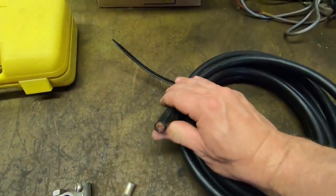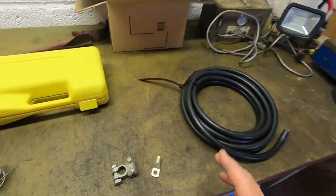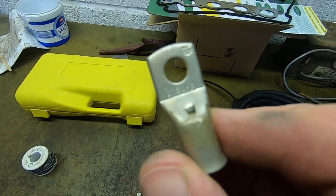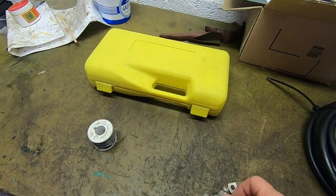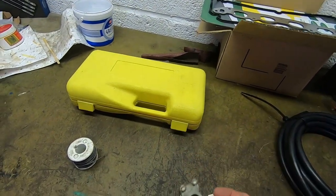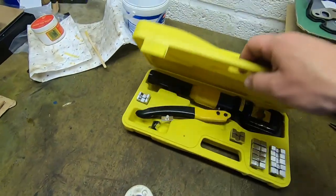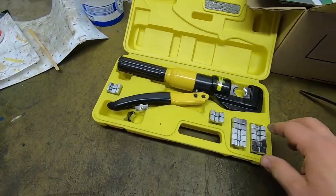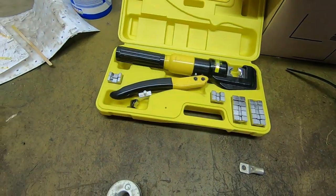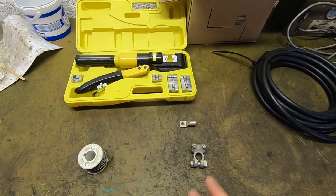I've got some bits together — some really chunky cable. I think it's 50mm, and I found a matching crimp lug to go on it. I found one of these screw-type connectors but I'm not a great fan of those, so I might try to crimp it and solder it as well. I've got a crimping tool I bought ages ago from eBay and a little gas soldering iron I've borrowed.